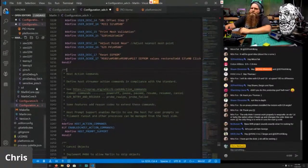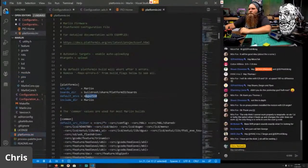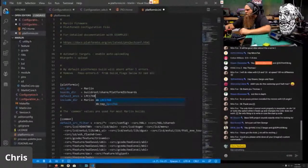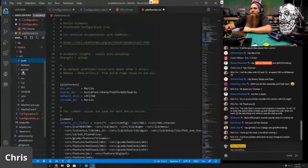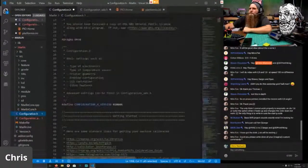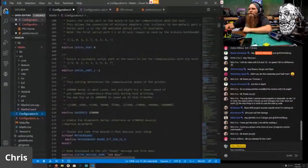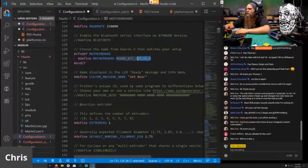Okay, the next thing we have to do is make sure to go to PlatformIO and change this to LPC1768. All the custom commands are on my GitHub, which the link to the GitHub is in the description. So, let's go back to Configuration.h. So we have a stock printer, should be good to go. And boot screen, yes. 0, negative 1, 250,000. And SKR Bear, correct board.